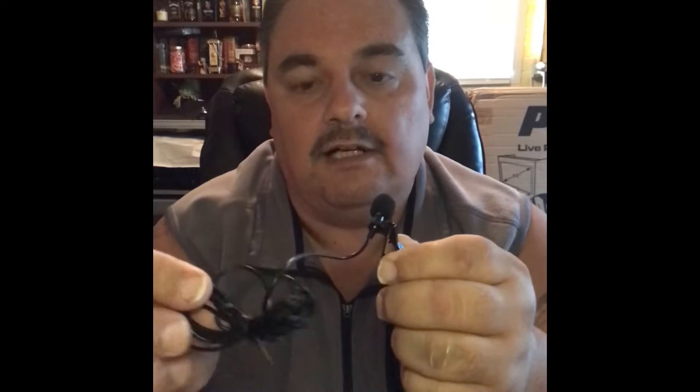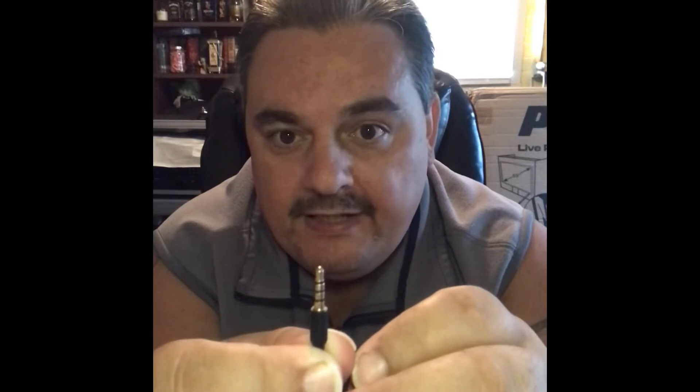This one from GitJets is a miniature lavalier microphone that can be used with your iPhone, Samsung Galaxy, that type. It is a lavalier microphone with a four-foot cord. It also comes with another six-foot extension cord, and it is a TRRS connector. So you have to make sure you get the right adapters — always count the little black rings so you know what type of adapter you need to mate it up. If it doesn't go in correctly, you're not going to get sound.